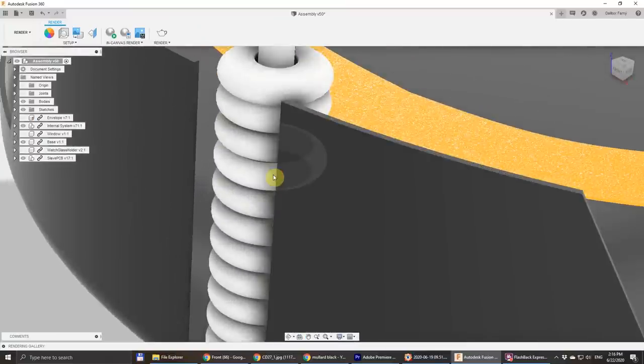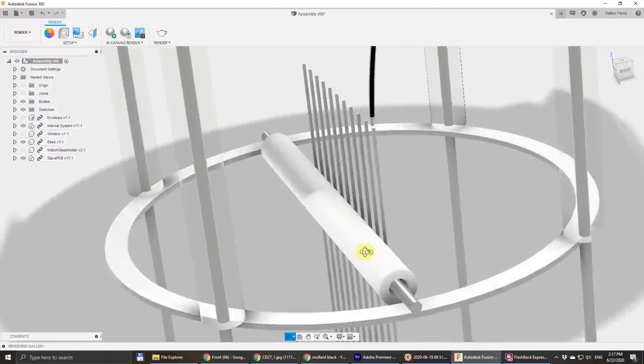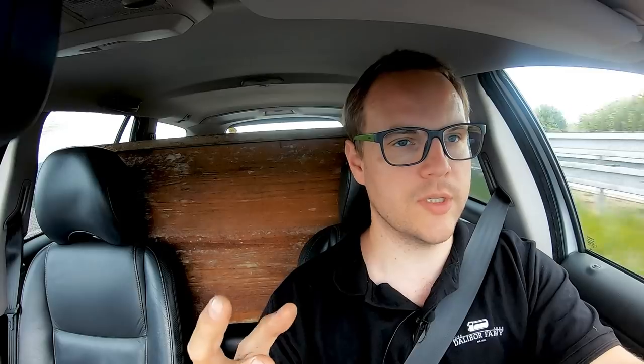Another thing is the ceramic parts used inside the tube. In our regular tube we have ceramic insulating rings between the digits, a ceramic rod in the middle of these rings used for threading the digits onto it which holds the whole stack together, and two ceramic tubes glued on the stem which provide support during sealing and make the internal structure more rigid. As the material for these ceramic parts we will use alumina — pure aluminum oxide — which is proven to be really good material. It's resistant to high temperatures, it's pure so it doesn't outgas any impurities or gases to the vacuum, and it's dense enough so it doesn't contain trapped gases.